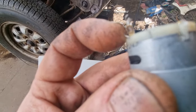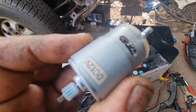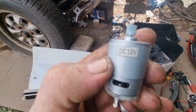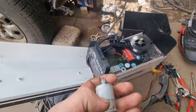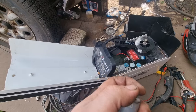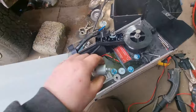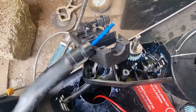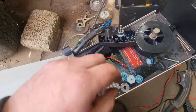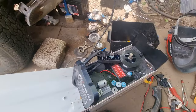They were just touching like that — they're supposed to be on the connections properly. The motor looks good, the brushes are clean. It's only a 12-volt motor but it's smooth. So I'll dig out my old soldering iron, solder that back on, and hopefully I can start doing some more welding again. Brilliant news all around. I know where all these go — it's quite simple, they all connect to one another. I don't know why spraying WD-40 made it work again for a few times; it was just a bad connection. Back with you soon.